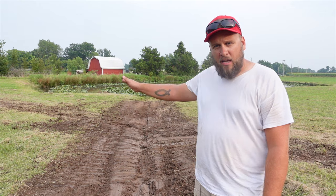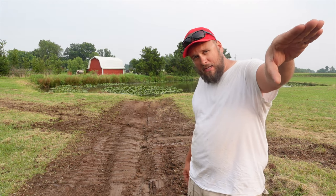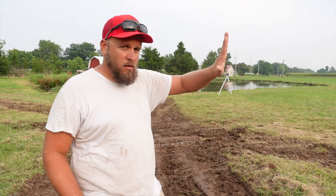I now have about a foot of drop to the center of this — that's fairly gradual. It's not perfect and not exactly smooth, but I have a consistent grade from that end to this end, and a grade from each direction. It should funnel water down here. If anything, I'm hoping that if it rains tonight like they forecast, it washes this out just a little bit more — I'd like a slightly smoother slope down on each side. I'm also happy I've leveled out where the hump was where I removed the fence. I'm going to be doing a lot of drainage projects on the property: on that side of the house, down the driveway, down the fence over here, more running to the pond, and expanding the pond to catch what runs down this way. This was my first large swale like this.